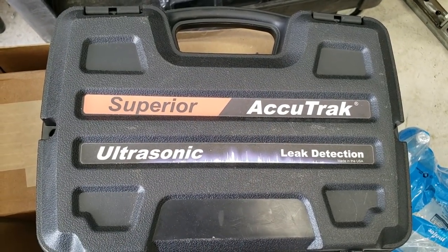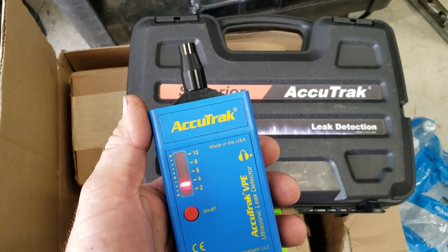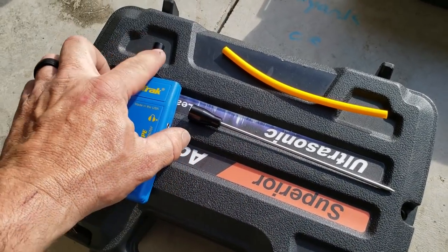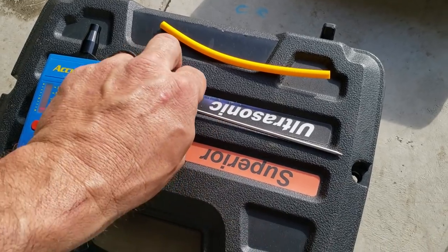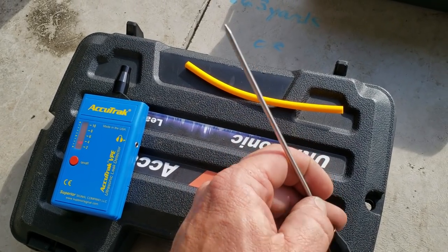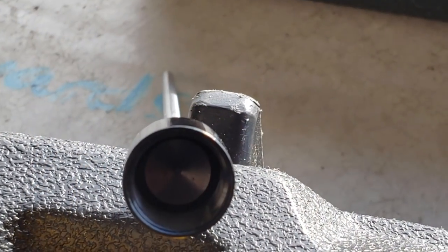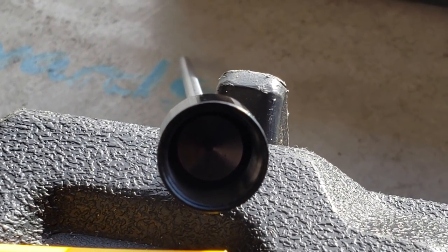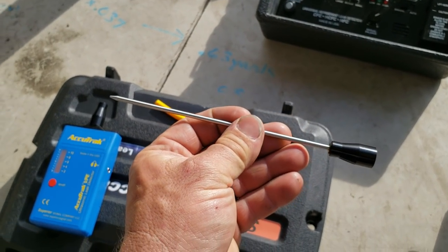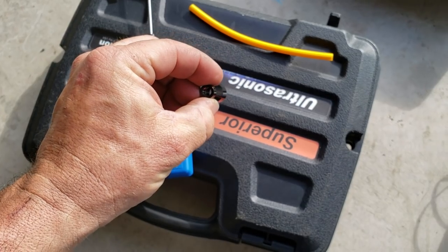It comes in a little case like this. It came with basic headphones. They have an upgraded version where you can get either the gooseneck or the standard. The difference between the gooseneck and this model here, which was the original version, is that this piece unscrews, and you can screw on the sensing element, and it's like a stethoscope. You can actually hear inside of devices like TXVs and steam traps, and identify whether they're feeding through. There's a little diaphragm inside that transfers the noise from the stem, which looks like the same diameter as a thermometer probe. You unscrew the tip that you had on there previously, which is the cone that helps direct the sound into it.